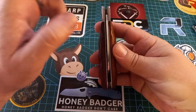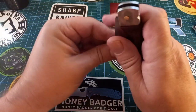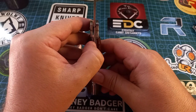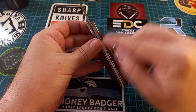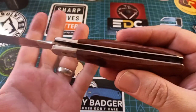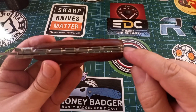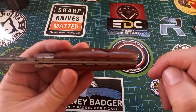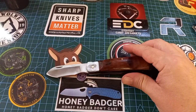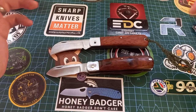The problem is the back spring — the thing that makes it a slip joint. The spring has nothing in front to keep it in the middle, so now it's off towards the side. But look — the blade is nice and centered and we can see our brass washers in there — well, coppery washers, I hope it's brass. We have a uniform gap at the back because we have spacers here and here. Maybe the back spring is bent, I don't know. Either way it still functions as a knife, it looks like a knife, and it might even look a bit better than it did initially. It had a blocky handle before, and now it looks like this.